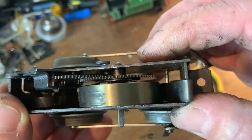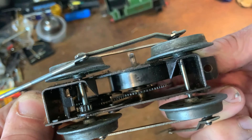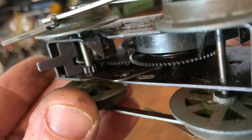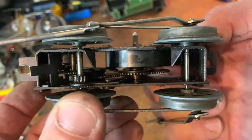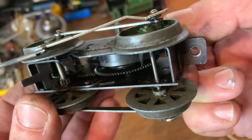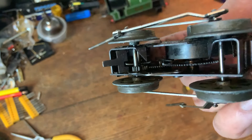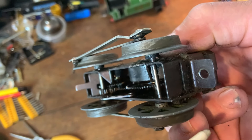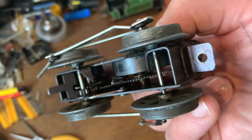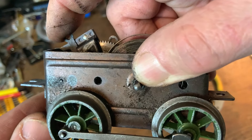Now I'm going to have to do all of them. What will I do with the mechanism? I could completely submerge it in a cleaning fluid and wash it out, but I'm just not wanting to do that — it survived all these years and it's in good repair. I think I'm going to add a little bit of lubrication to each of the bearing points, clean off a little bit of this grubbiness, but I'm not going to get too carried away. I want to use this — I don't want to take it apart — because you only bend these tabs a few times before they'll snap off. So I'll just clean it up, re-lubricate it and run it. Here's the gear lever — let me check that out. In this direction there's a small gear that moves into mesh on that side of the motor, and when I move it in this direction that little pinion is now meshing on this gear. Very simple. And look at that — a working brake again.